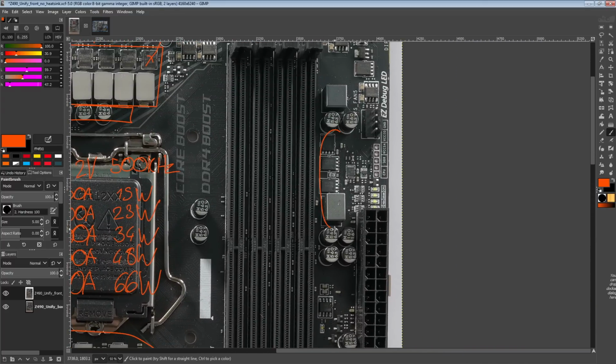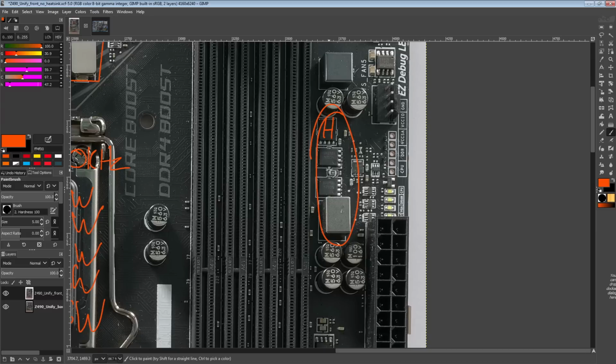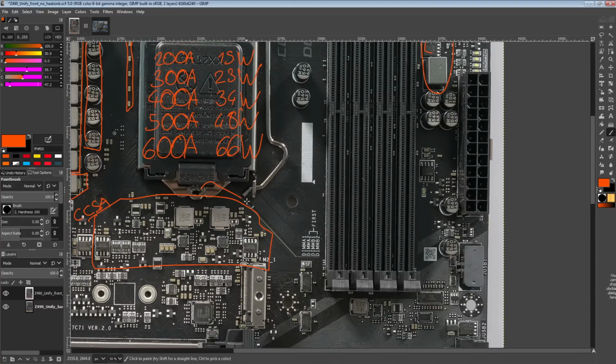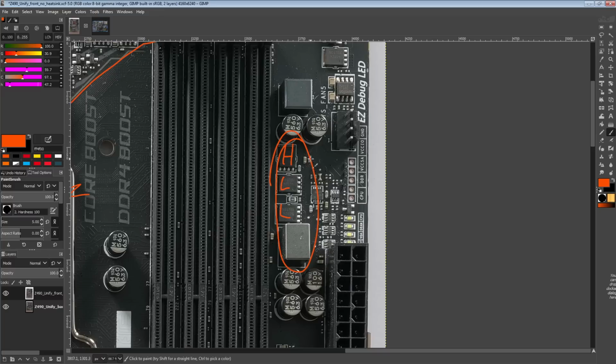Then for the memory power, we've got this right here, where MSI has finally stopped doing the 4-MOSFET memory VRM. So now we just get 3 MOSFETs, which is still more than enough. The thing is, DDR4 doesn't pull a lot of power, and this is just a single-phase VDDR, but memory is very much not about how you power it. It's far more about how you connect it to the actual CPU, right? And we'll get to that. So for the memory VRM, single phase, the MOSFETs are a 4C029N high side, and then two 4C024Ns for the low sides. So that's these two right here.